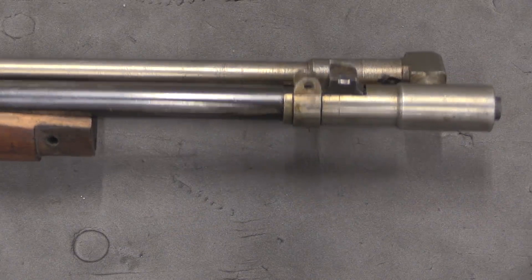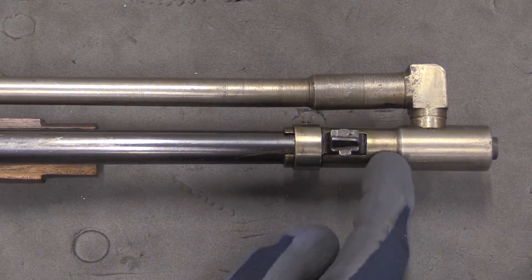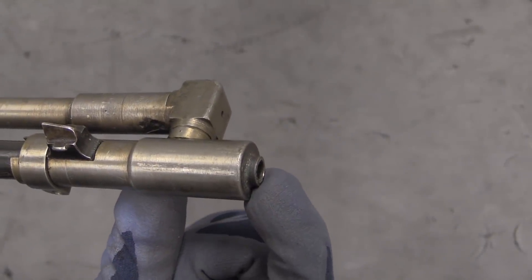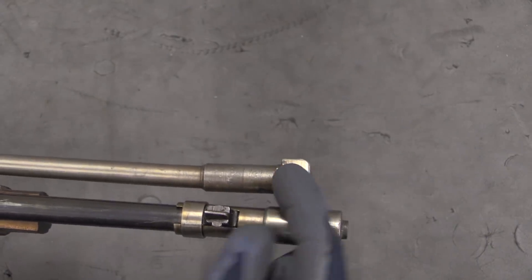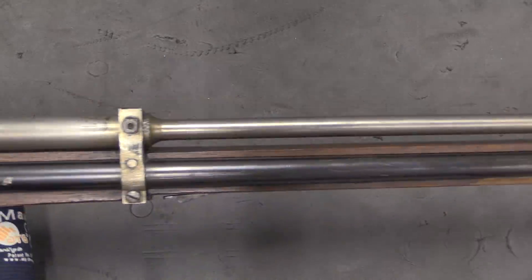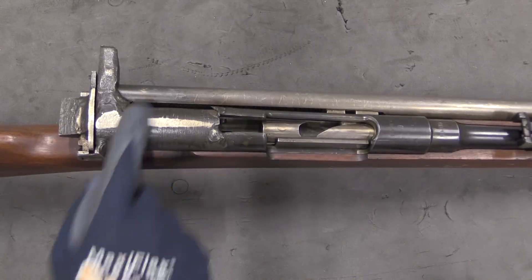We'll start taking a look at this up at the muzzle. What they've done here is actually add a gas trap chamber to the very front of the rifle. The muzzle is right about here. We have this hollow chamber, which then has a smaller diameter muzzle. Gas fills up in here, and back pressure from the small diameter muzzle forces some of it to go into this tube, down that 90 degree junction, and down to the gas piston, which is located all the way here at the other end of the rifle. So the gas tube comes all the way back to here.